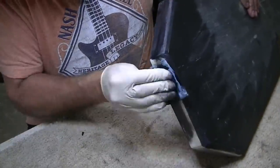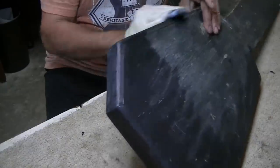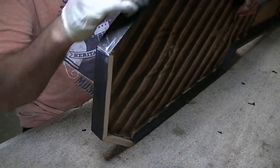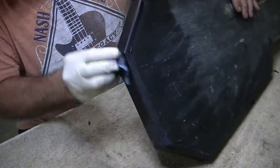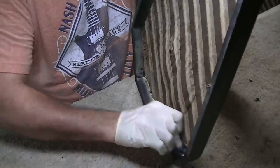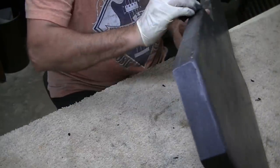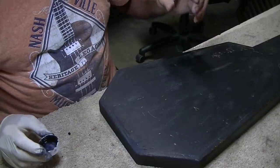This is the new wood that I put in there — I beat it up a little bit and rounded it off on the corners kind of like the original is worn off on the corners, and you know it matches pretty well. I believe this is poplar and the wood I put in there is also poplar — it's got the very same kind of grain look to it. Going over that a little bit more to get the black a little darker because it doesn't look quite as dark as the original wood. It's nowhere near completely finished yet, but I'll go ahead and install the lid back on the case and work on it together to try to make the whole look blend together.